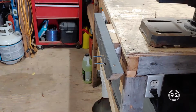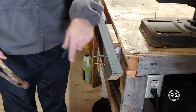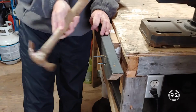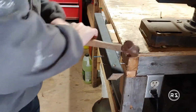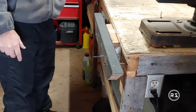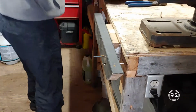Everybody who works in construction or renovation, I've seen this situation before. Some dangerous nails sticking out of a piece of wood and not having enough room behind to put the hammer and remove them. Even if you tap the nails, you can't get rid of them completely because they are stuck, in this example, on my workbench, and it's still sticking out. So it's dangerous, and you can't cut your piece of wood because you will damage your saw on the nails. Even with my framing hammer, I can't reach the nail. So in this situation, your best way is to take a pair of general pliers and cut the head of the nail, so you can remove it from the other side of the piece of wood.